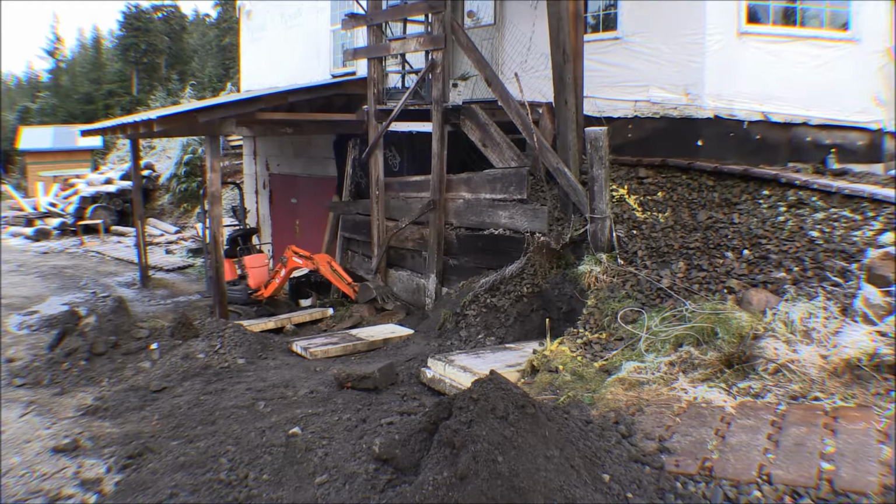of the house here. Well, I've got those dug out to hard pan, and I made some boxes for footings for them that I've stuck down in the holes. I've got to finish cleaning out the 3rd hole down there. I've got it dug out to hard pan and just pioneered out, but I didn't know what size the footings were going to be on it. So now that I've got that done, I can go and finish digging that hole out. And my post will be about 9 feet tall.